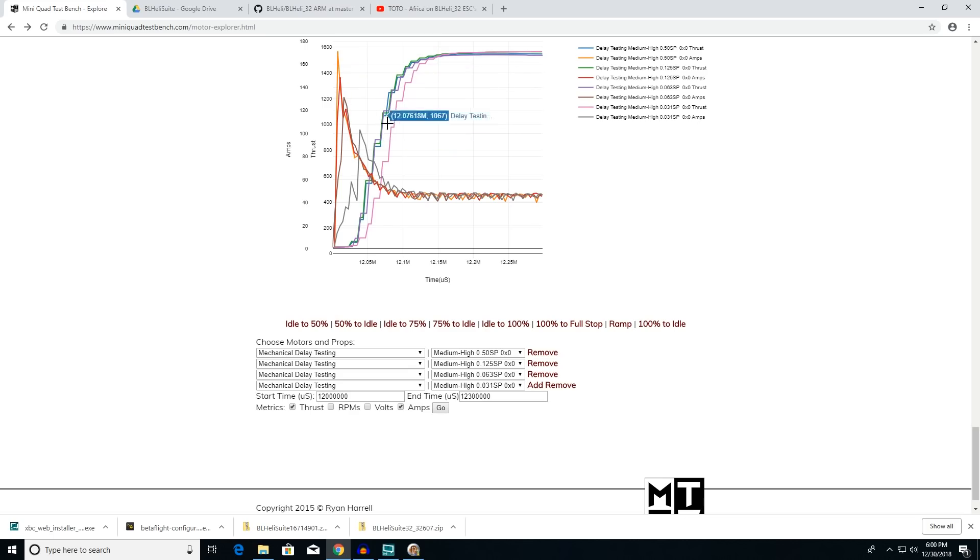People might think turning this down will give you longer battery life — no, that's not it. Where this actually potentially makes a difference is if you've got a 20 amp ESC and your motors are frying it. That current spike is right there, and 20 amp ESCs can be more susceptible to voltage spikes, even though technically they're rated to the same voltage. I run 20 amp ESCs on some ridiculous setups — a well-spec'd 20 amp ESC will do fine. But if you're popping ESCs, or if you want to try reducing this a little bit, that may help reduce those transient current spikes.